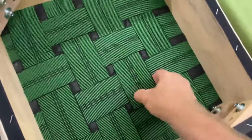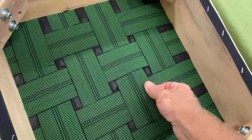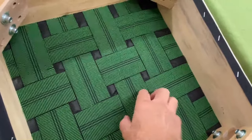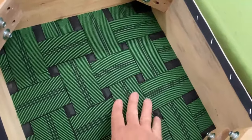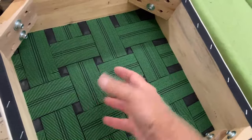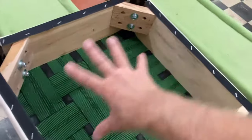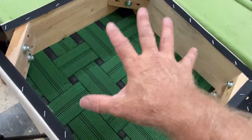You can see here that this rubber webbing — they put a sufficient amount in here. It's not the thickest type of webbing; a lot of the stuff I use is thicker and more suited for seats. This one feels more suited for backs, but it's still rubber webbing that's been put to a lot of use. Currently this seat is sagging in, so what we're going to do is make this seat feel like it's got a spring unit in it, and I'll show you how.